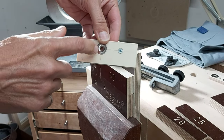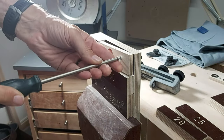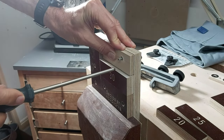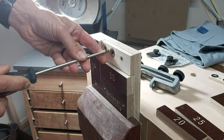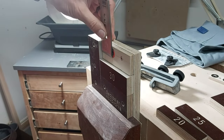So I've got this little block with a couple of magnets and a couple of screws that does just that. It pushes the plane iron or chisel out, and it has the advantage that the magnets will hold it there for me — I don't have to hold the plane iron or chisel myself. I can just drop it in place and the magnets hold it, which makes it quite a bit easier.